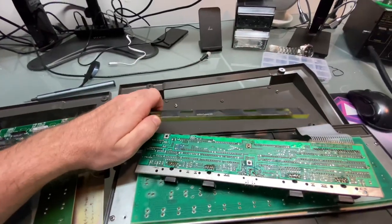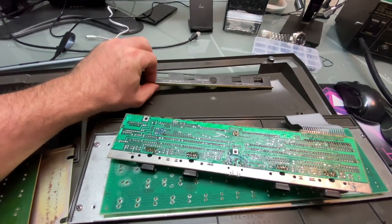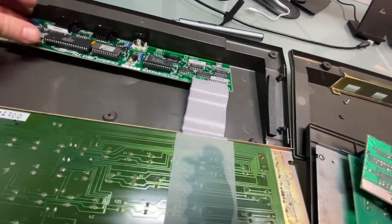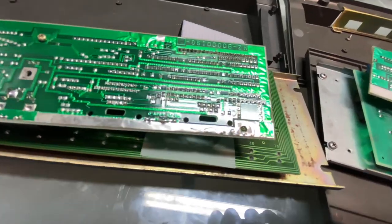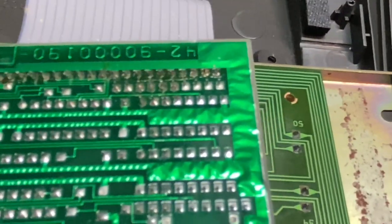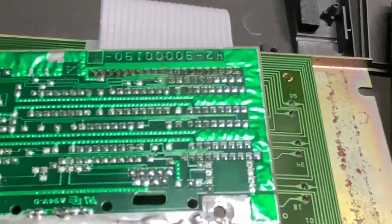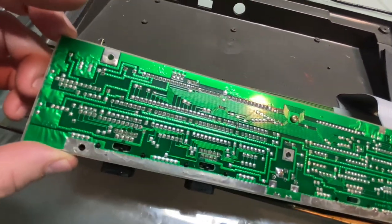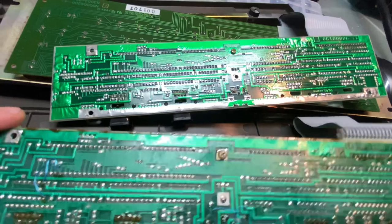When I took the PCB out of the prototype board, this metal plate came out that was here, and it's not part of the mold. It's actually like a big thick metal plate. You can hit someone over the head with it. And this mold has the holes just cut right into it. So that's interesting. You'll notice what we just showed on the other board about these grounds. Rather than having the pins grounded by little wires, they have traces there now. The rest of the PCB looks good. Like there's no wire jumpers. As far as the actual layout and design, very similar.